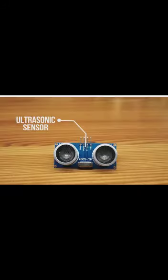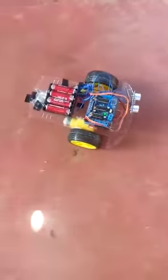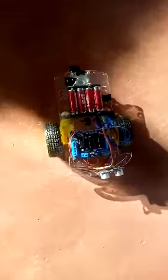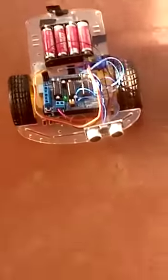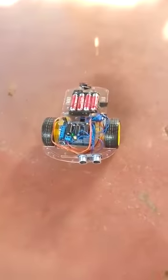In this case, our smart car will be having an ultrasonic transceiver. What that means is that this smart car will be blasting surfaces with ultrasonic waves. These waves will hit obstacles, and the moment they hit obstacles, they shall be reflected back to the receiver, which will help the Arduino board to know the position of the smart car relative to the object. The most important bit is to avoid colliding with obstacles. It's quite easy. So let me just show you the parts that we'll be having.